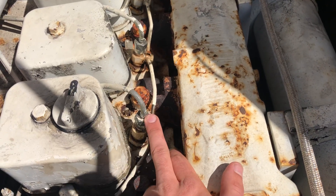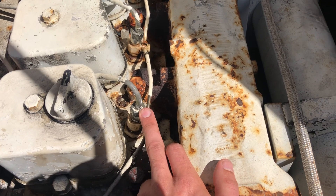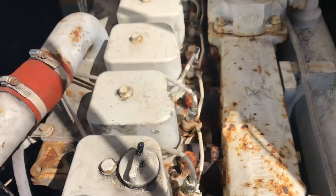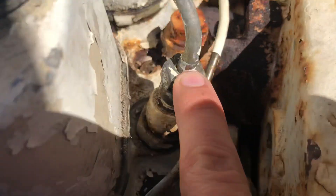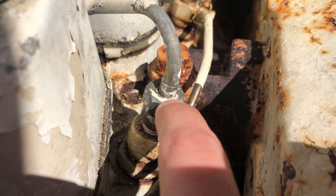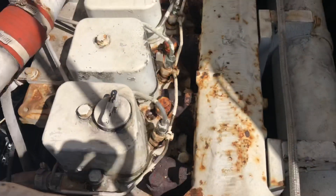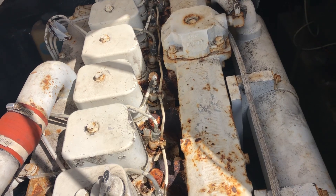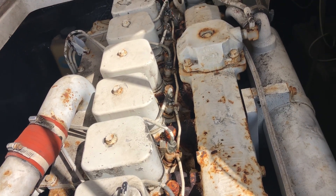Crack these loose just a little bit and you may see some red fuel come out with some little bubbles — that's a good sign; you want that air out of there. Turn it over again once more, get a little more red fuel coming out from the inside edge right here — between the fitting and the hose. Then once more tighten them down, try to start it up again, and that should start it right up. A good hot battery helps, and that'll purge your fuel system.